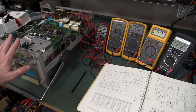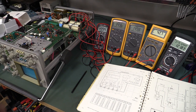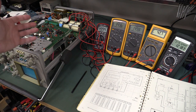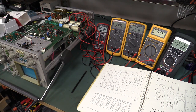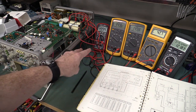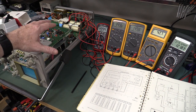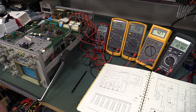Just a follow-up video to this HP 1740A 100MHz dual channel analogue oscilloscope and the repair of this thing. Where we got to last time was that once we took the case off, it basically would not fail, except for one very small capture I got by coincidence as I was tweeting a photo where all of the power rails — 5 different power rails on the output of the secondary linear transformer in the switch mode converter supply — all dropped at once.